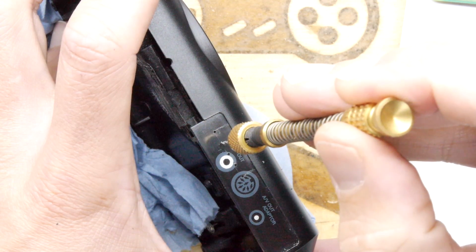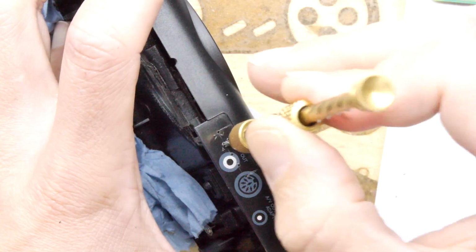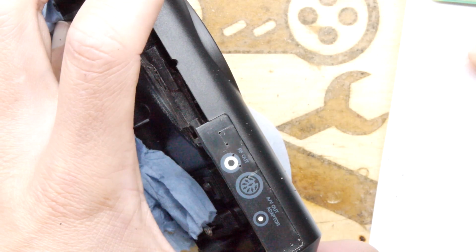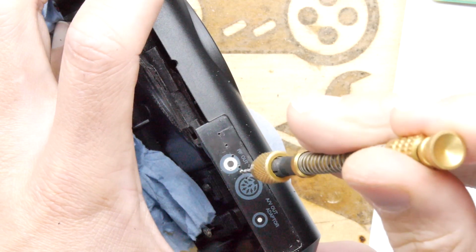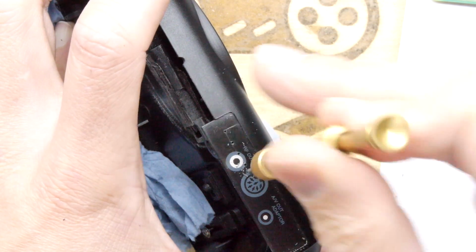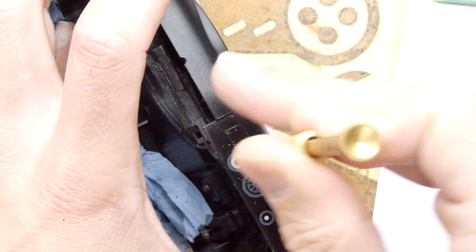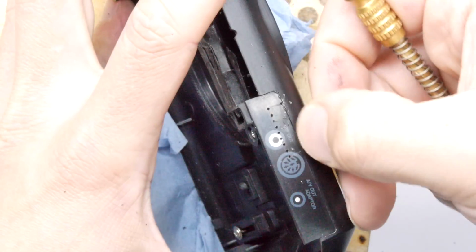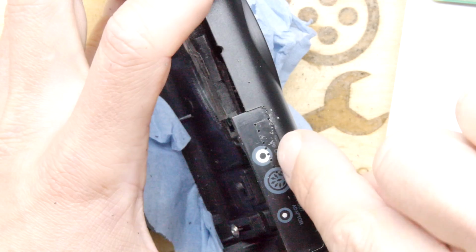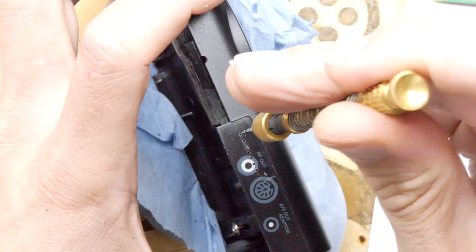So I like to put one on each end, and then put one in the middle, and then put one in between that, until you're just dividing it down: halves, quarters, eighths, sixteenths. Keep going until you get bored. The more you can do, of course, the nearer you will be, and the smoother your final HDMI hole will be. Now if you want to do a really nice job, do it on this edge as well. I know you've got this plastic edge, but when you're trying to run a grinder or a little grinder, something like that, up against that, you'll easily go through that. So yeah, holes on that edge too.